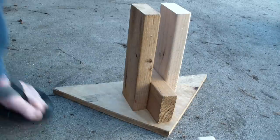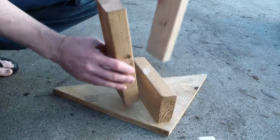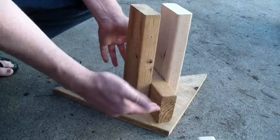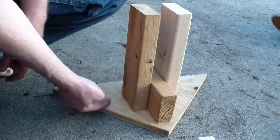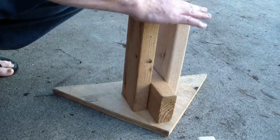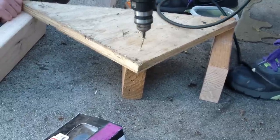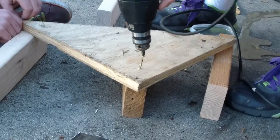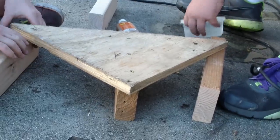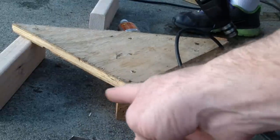We've come up with the design for the footer. I had some plywood laying around so I'm going to use a piece of plywood as the base, then screw a 2x4 to it in the middle and put two risers on there, then bolt the rail in between. That way the 2x4 helps keep it laterally strong. We're putting the middle bottom piece in first with some glue and some screws, and then screwing the side pieces to that next.